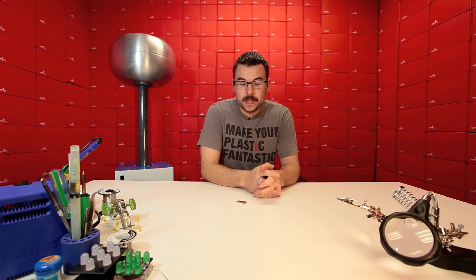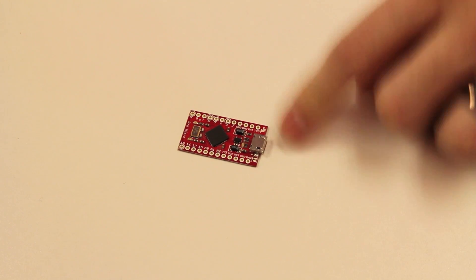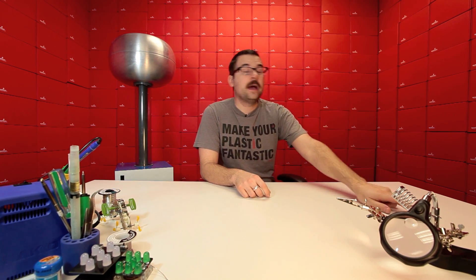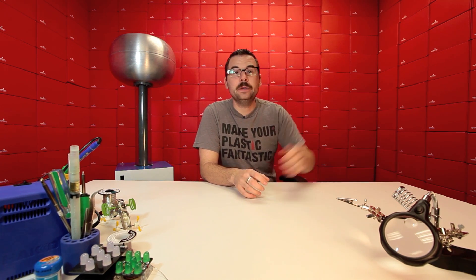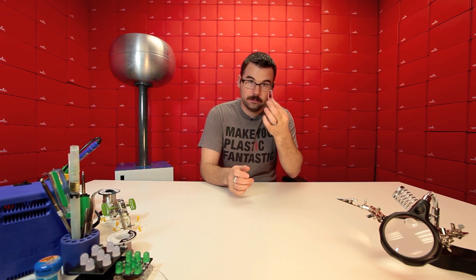Many of you may be familiar with the Arduino Pro Minis that we've been selling for quite a long time now. Here is a new and exciting version of that — this is the Pro Micro. The Pro Micro is the exact same form factor as the Pro Mini, but it has a couple of interesting changes. This one actually has a USB micro jack on it, thanks in part to the Atmega32U4 that's on it. Instead of using the Atmega328 like the Pro Mini has, we've got the Atmega32U4. The 32U4 has built-in USB, so we don't need a separate FTDI chip or FTDI header. The nice thing about this board is that in the same size as the other board, you get everything, including the USB interface.